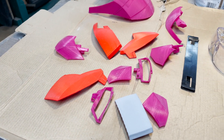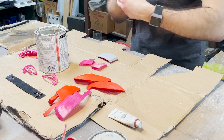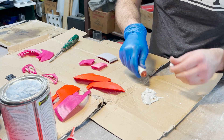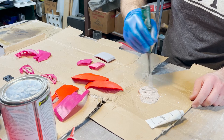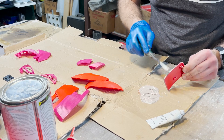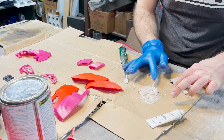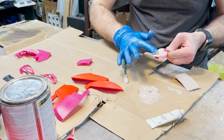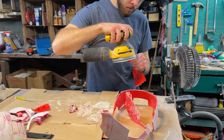After the many hours of printing, I took all of my parts to the dirty side of the shop and mixed up Bondo to spread on all the surfaces that would be visible. I prefer to apply Bondo before the filler primer because it does a better job covering initial layer lines and sands much cleaner than primer. I sand the primer as little as possible because it really likes to clog up sandpaper, whether wet or dry. Bondo tends to set fast, leaving very little time to work it into details, and it makes my entire shop smell like my great aunt's house for some reason.